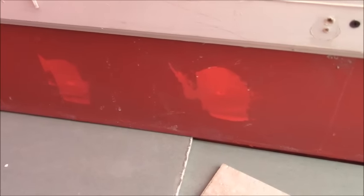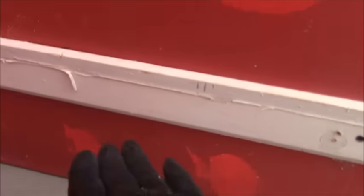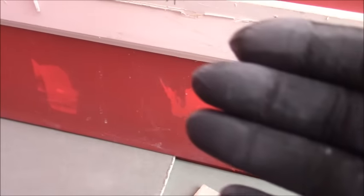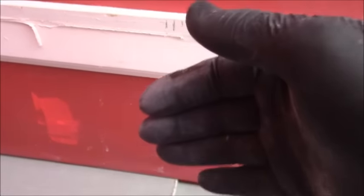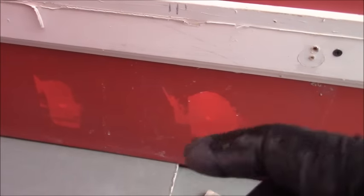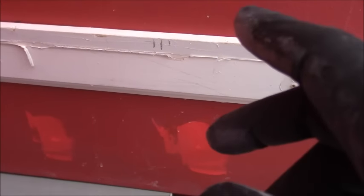And it would take me typically on a shower an hour and a half to 2 hours just to set the bottom row of tile, and then I'm stuck because I can't really set more tile, maybe one more row on top of that. But you always run into the danger of whatever you have down there as a spacer getting squished down there. It's an antiquated way to do it. I never really understood the ledger board process. Once I understood that, and ironically, I learned it from Tile Master GA years ago, I had seen him use a ledger board and was kind of curious about it, so I started integrating that into my work.